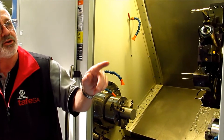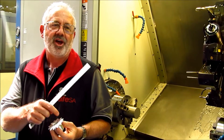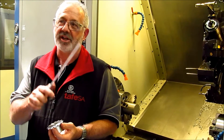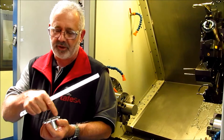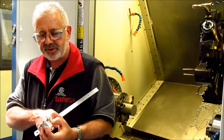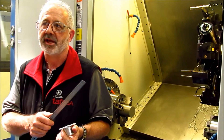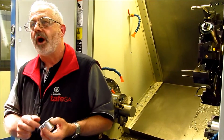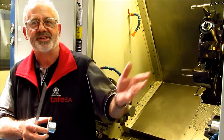The program I'm going to run is a mixture of approaches. I output this from Solidworks — I designed this on Solidworks because I used to make my own sprockets for racing, a bit of a pet project. I've got a design table in Solidworks linked to a spreadsheet, and I got all the tooth form dead right off the tooth form specs out of our machining bible. Then I imported that into a CAM package — Mastercam X4, or 9.1 I think it was on this one — and put a toolpath over it. Then I did a bit of my own hand-written program as well, so it's a mixture of my skills and software.